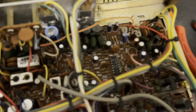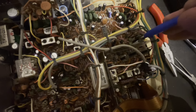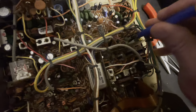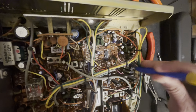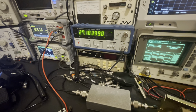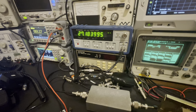Now I'm going to get on the transmit offset trimmer right here and adjust a little more. It's very tough to get onto those little trimmer capacitors with one of these tools, but I don't want to use anything metal. Now I'm finally in the slot and keyed up again — and we're on frequency, right where we want to be.